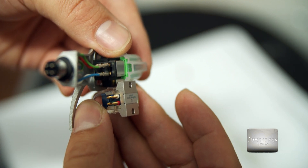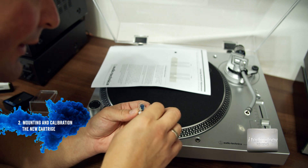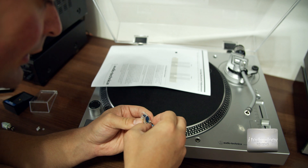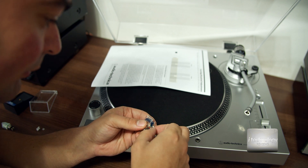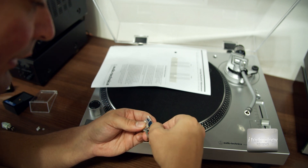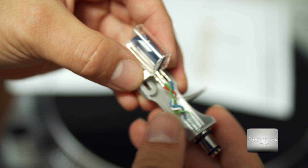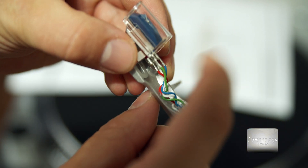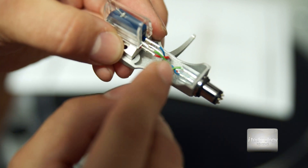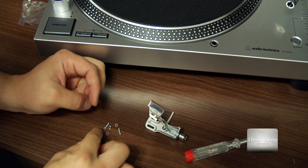We have 1.8mm clearance. Take out the old cartridge. Start with the red wire — push it firmly. Then the white wire — put the base first and really push it to feel the end. Route the wires so they are rounded once and flattened against the base so they don't loosen up. We have two types of screws — the small ones aren't needed here.